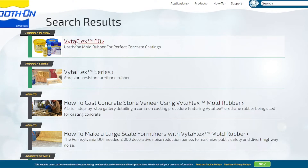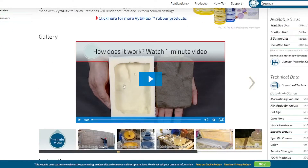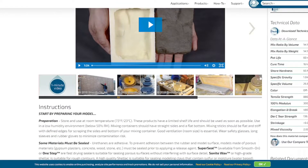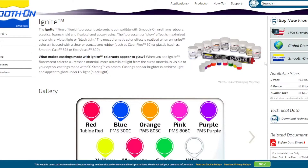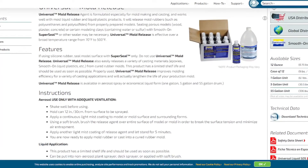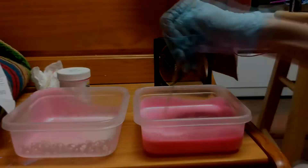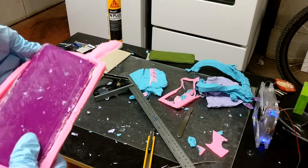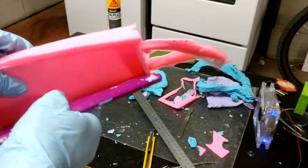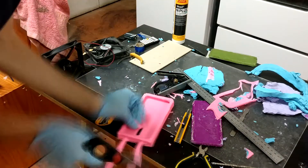I think I'm going to have to get a sturdier rubber or something. So I went looking around and found Vitaflex 40, which is as strong as I originally wanted it to be. But then when I went to the store, it seemed a bit too soft, so I went for Vitaflex 60 instead. Because this wasn't pink on its own, I had to buy urethane rubber pigment, and because it was urethane rubber instead of silicone rubber, I also had to buy the spray-on release agent so it wouldn't stick to everything. I came home and cast it — it is super hard compared to the first one, which is better I suppose, but the color is a bit too dark, the borders looked terrible, and the ears still have bubble holes in them.